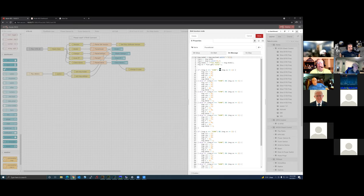The 6300, the 6500, the 6700, they don't have a fan meter. There's no meter to monitor the fan speed. There's four fans in those model radios. There's two case fans, and there's two fans, one on the CPU, one on the FPGA. And none of those fans have internal metering to say whether the RPM of the fan is working. So the only way you know is when your radio starts locking up.